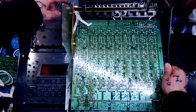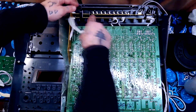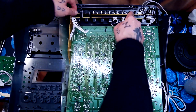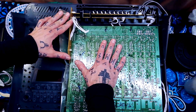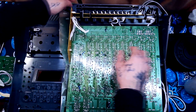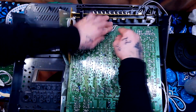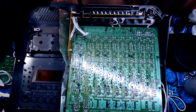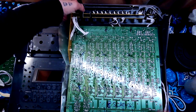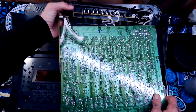We've also got this board here running perpendicular. Probably the easiest way to get this mounting plate with the socket daughter boards separate from the mixer board and joint board is to take the whole thing out. That requires removing an additional four screws from this plate — again going into plastic mounting posts, so they're all the same screw type. Once done, the whole assembly lifts up.